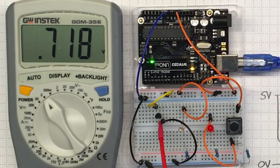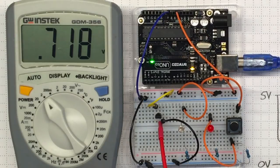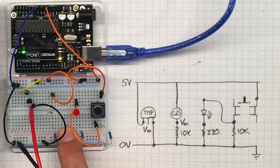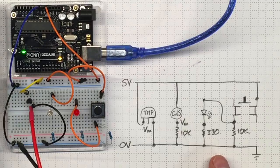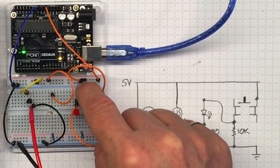If I switch back to 5 volts, I still get the same output from the TMP36. Ratiometric versus non-ratiometric — that's going to turn out to be important later. Now you can build this circuit yourself in the lab. You can follow this schematic or the layout diagram — in this case they look very similar because I've made the schematic match the physical layout on the breadboard, making it easier to understand and explain. You could also lay out your breadboard compactly, connecting back to the ground rail to fit things in more efficiently.